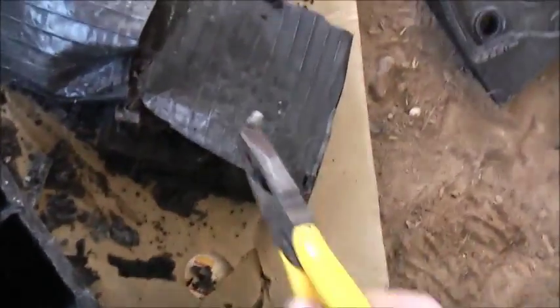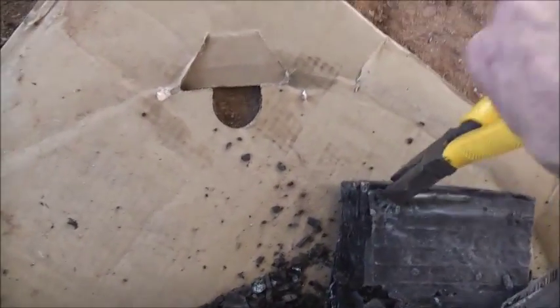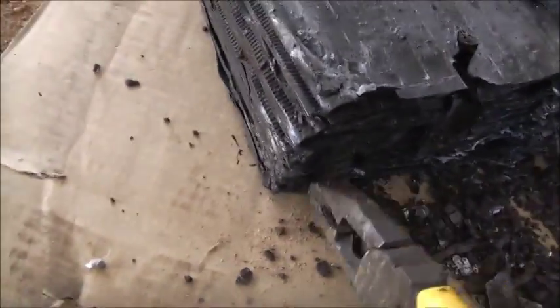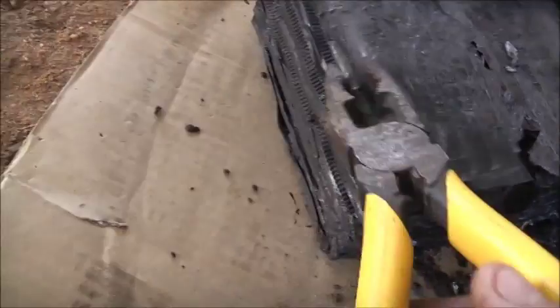What Exide have done, it looks like, is they put silicone in the cells here. It goes down the sides of the plates. There's some there, more in there. They're stuck together, see? So in there, we have silicone in between here, holding all these separators together, on both sides. Some on the outside here, and a bit there on the wall. They've actually glued them in place into the battery casing, and that secures them quite nicely.